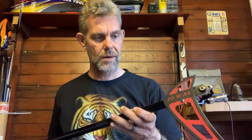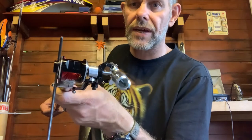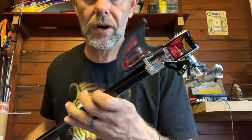There we go, I'm content with that. That is the rear tail fin now mounted. The block is located correctly into the hole. We can see that there. There are no gaps in between. And I've complied with rule number two of the general rules, which of course is construct it first and Loctite it second. So I'm going to Loctite it and then we'll look at the front drive.